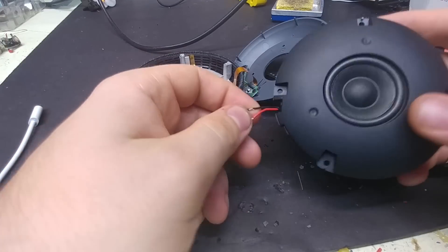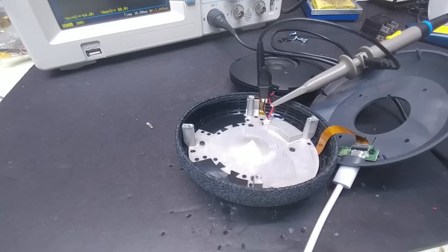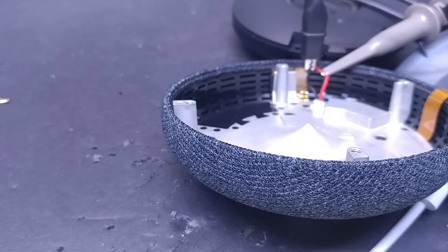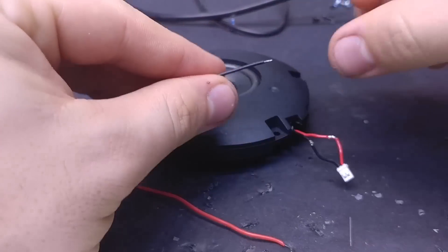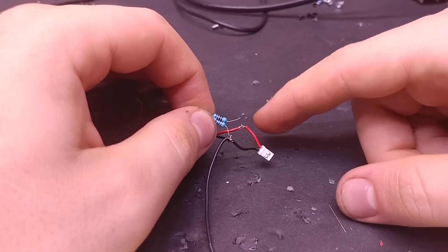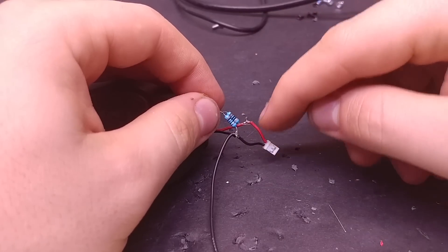I'm going to be measuring the voltage on this to see how much we have to reduce it for the one volt line out. Hey Google, tell me the news. We need to reduce that by 10 or so, so we'll use a 10 to 1 voltage divider. At Snack Tech we don't care if things are perfect, we just want it to work. Now we can flow some solder onto these joints. At Snack Tech we don't do drugs, but we still have joints. The 300 ohm is the bottom one and the 3K is the top one, and we're going to connect it like this. That's going to cause the voltage between this node and this node to be a tenth of the voltage across here — or the auxiliary output wire.